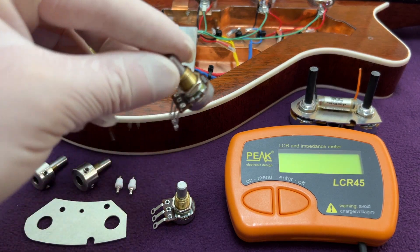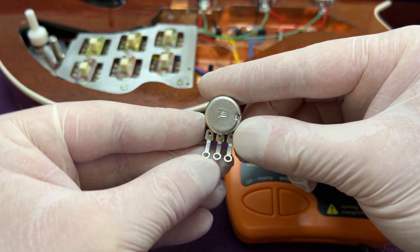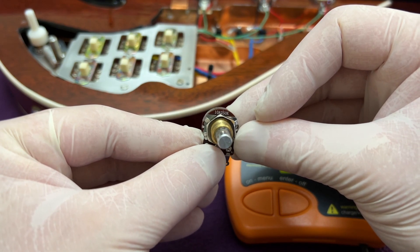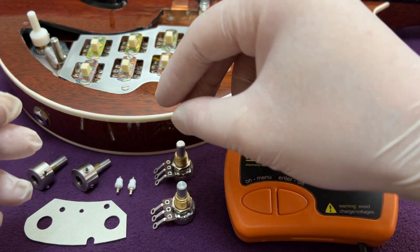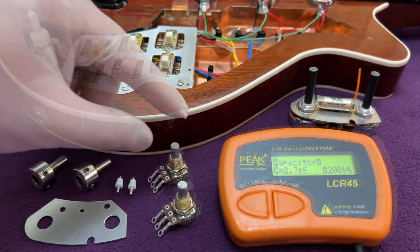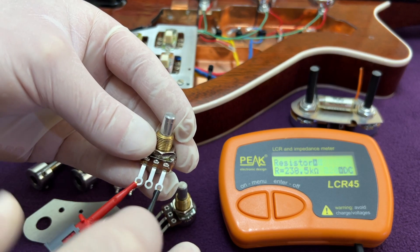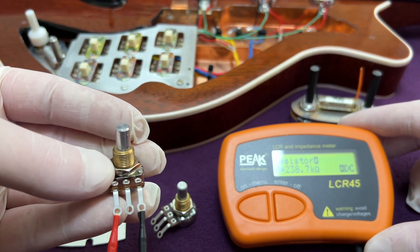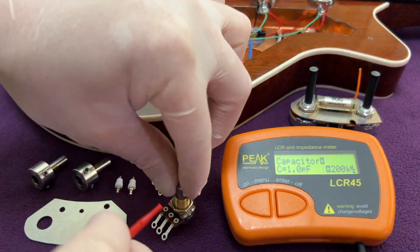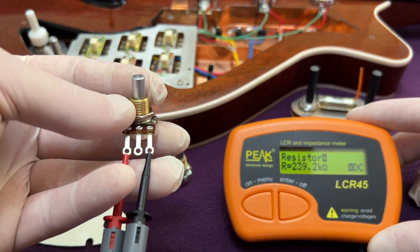The original long-shaft potentiometers have been replaced several times over the years. In 2013, Nigel Knight rewired the Red Special, and he fitted Bourns PDB-181 GTR Series plain shaft guitar potentiometers. These are part of Bourns's professional audio potentiometer range and are designed to meet the high quality standards required by touring musicians. You can see the assembly in this configuration in both editions of the Red Special book, written by Brian and Simon Bradley. I understand that the original Red Special 250 kΩ log pots actually measured 237 kΩ. I bought a quantity of these Bourns pots, which have a 20% tolerance, tested them and matched them up into pairs. Nigel Knight wired up everything for me and selected pots with this value. The pair I'm measuring here were the next closest, matched at 239 kΩ.